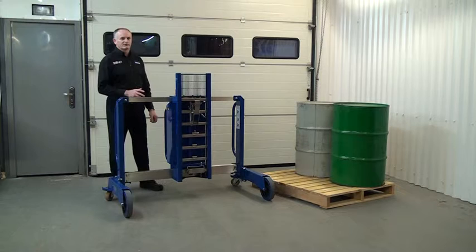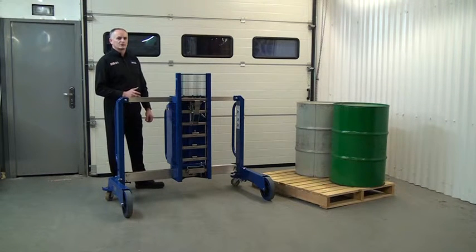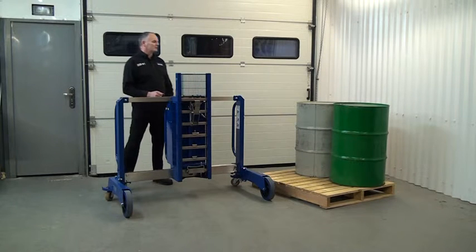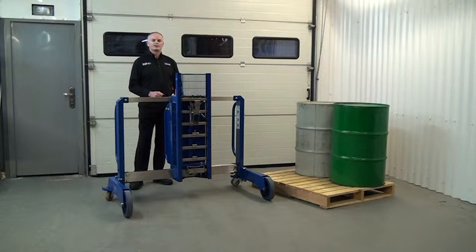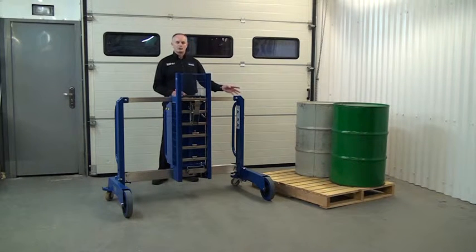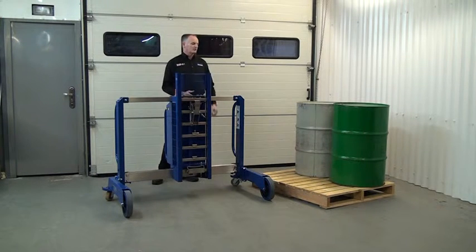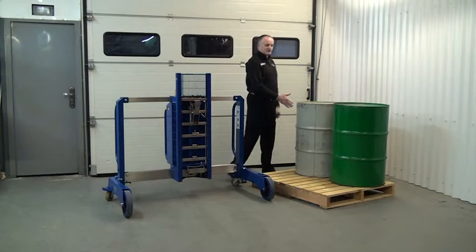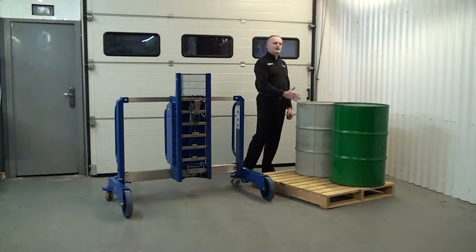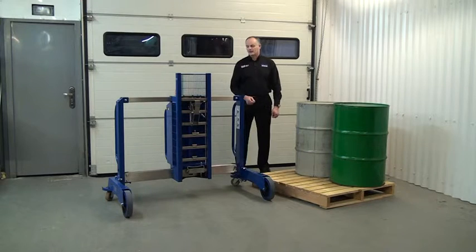This unit is suitable for picking up lots of different types of drums from 50 litre to 205 litre, steels or plastics. Today we're just going to show you on these steel 205s mounted on the pallet, but it wouldn't matter whether there's four drums, three, or two, because this unit straddles the pallet and goes straight over. We've mounted these at the back of the pallet so you can see the way the side shifter palletiser is able to access them without moving the pallet.